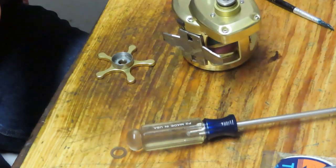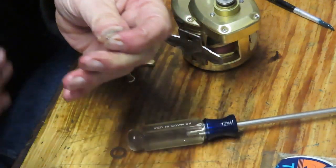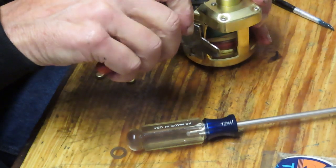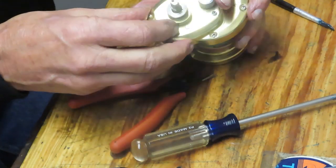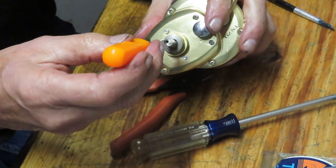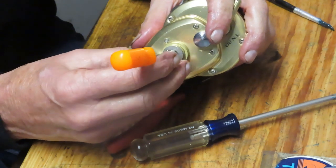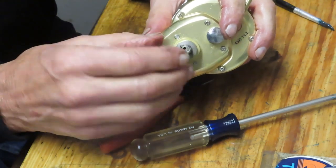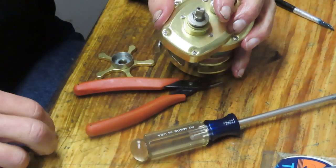Right here, that's what I call the rocket spring hole. I'm going to take the glove off for this just because it is a little bit delicate for me. I'm going to take that little stud. And interestingly enough, there's two ways to do this. This is the way I've settled on over time. One of the ways is to trap that with the top washer, which is what I do. The other one, you can actually put a toothpick, or if this thing can slide all the way in. Oh, it can. How do you like that? Not enough. You can grab that inner spring, compress it that way. That will pull in the little spring head here, and that will cause it to seat properly.